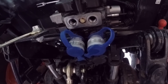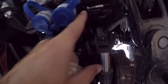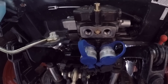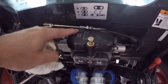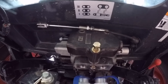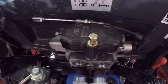Putting two together was way easier than getting everything to line up for three. I have to go through the top piece, valve assembly, spacer plate, valve assembly, another spacer plate, valve assembly, into the base — and trying to get all those lined up was a pain. Hopefully I didn't damage any O-rings, but we'll find out once I start it up. On the other bolts I'll put some blue threadlocker on them just to make sure they don't back out, so I don't have any problems down the road but can still get them out.